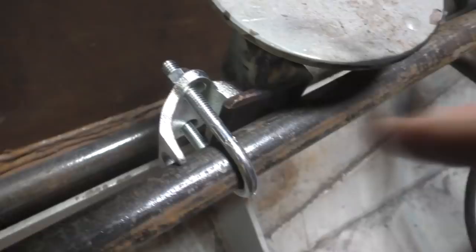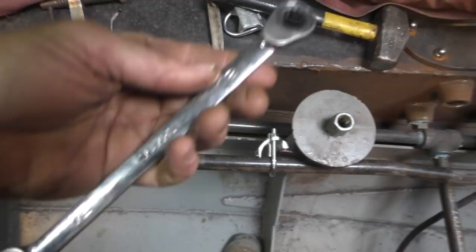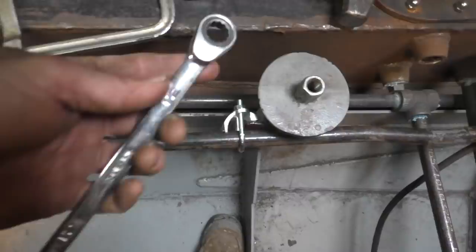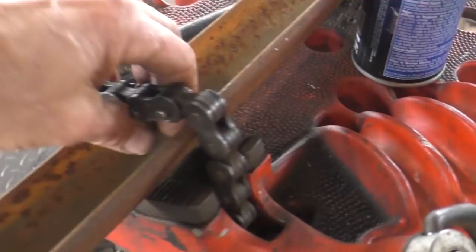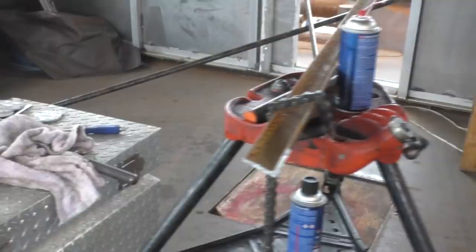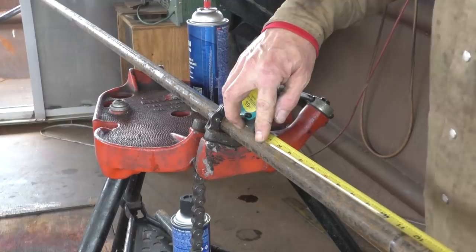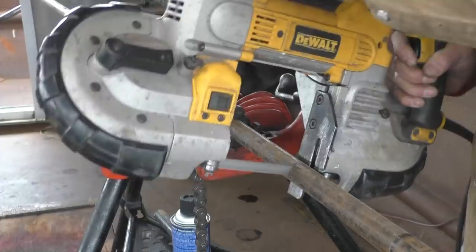A professional tool pad would be great except on a boat the whole thing goes in the water at one time. These clamps hang and weld onto our upright - just magic. I don't think I've ever touched a Snap-on tool before. Something I learned: pipe vices aren't just good for pipes - they can clamp anything, even fittings to pipes when tightening something small. Always when you cut a pipe off, put a thread on that end because you're going to need it sooner or later and it's already clamped.